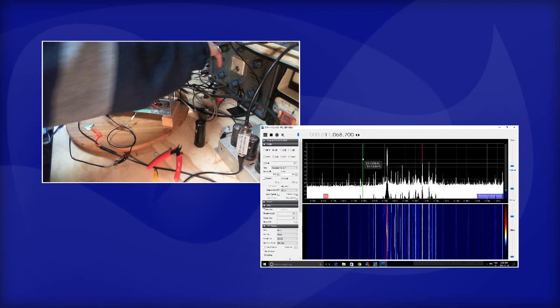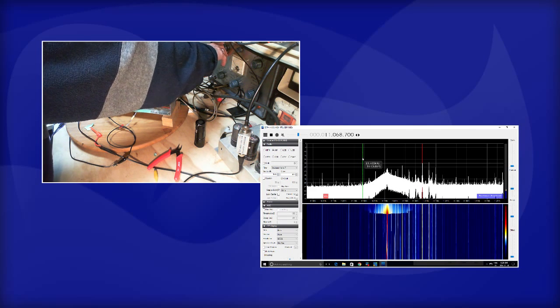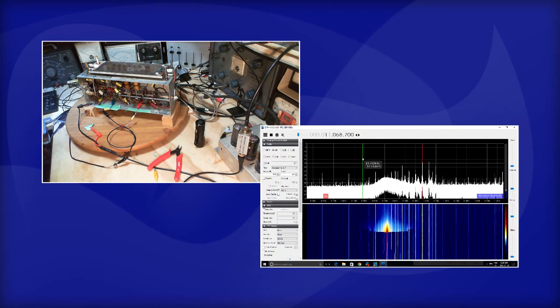Again, if we broaden this out, if I increase the deviation here from basically zero to something, we can get a look at the curve. You know, it does kind of work its way up into that noise stuff, or you can see that noise stuff does come right down into the IF a little bit. The bandwidth, I think I can turn on the bandwidth. Gray zone, let me set this to 10.7. So the red line marks exactly where 10.7 is. And, where did the gray go? There we are. And the gray is marking the proper bandwidth of the IF. So everything outside that bandwidth, you should not hear anything from it. But anything inside there could present some problems at the far end of the radio.